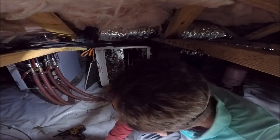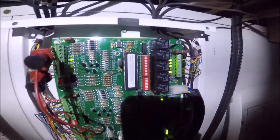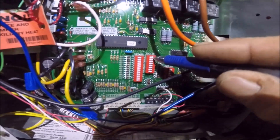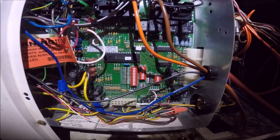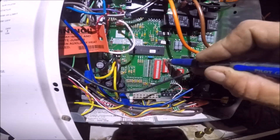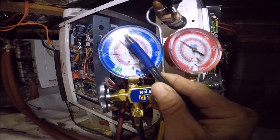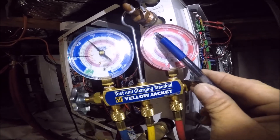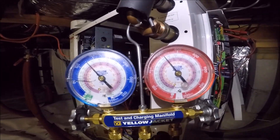I'm going to go get my geotools. Going to Y2 to red, speed up this timer. There's our compressor — it's 410A. So we want to see somewhere around 130 on the suction and 300 to 350 on the head. Of course we'll check our superheat and subcooling.